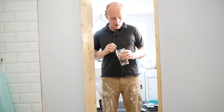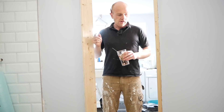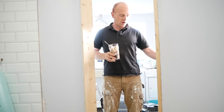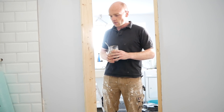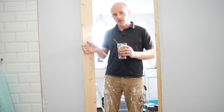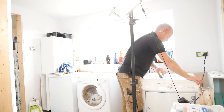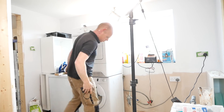While I'm continuing with my new diet — the truth is I made a bit of a mistake with the flooring. The flooring went down the last few days and as I was knocking in the laminate, because it continues through the room, as I was knocking it in over on this side in the hallway corridor bit, I've obviously slowly knocked the whole room of laminate because it's floating. So I've actually come away probably three, four, five mil more from the shower tray in the toilet area than I need to be. The whole lot needs to go out that way, but the problem is I've now got a tumble dryer, washing machine, and freezer all sat on it, so I've somehow got to lift those into areas without laminate and then shift the whole lot across.